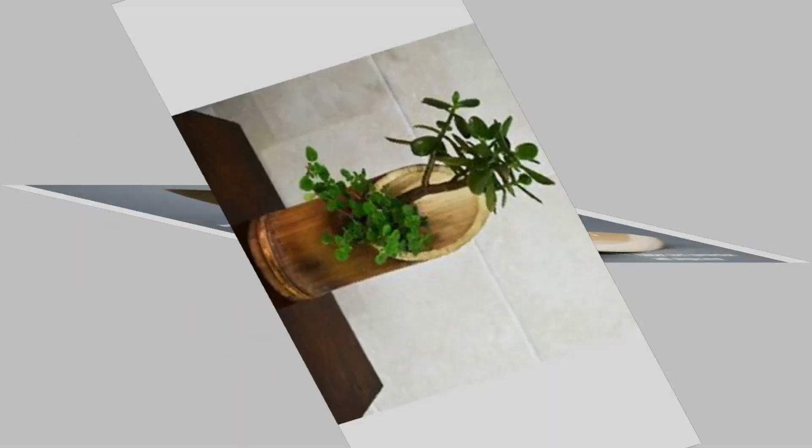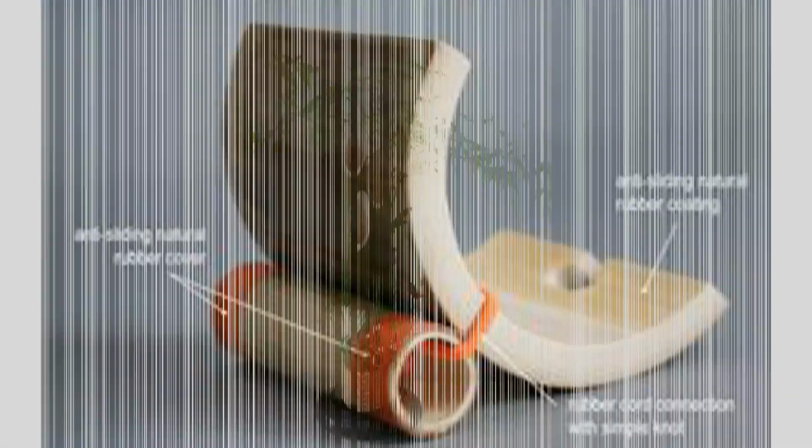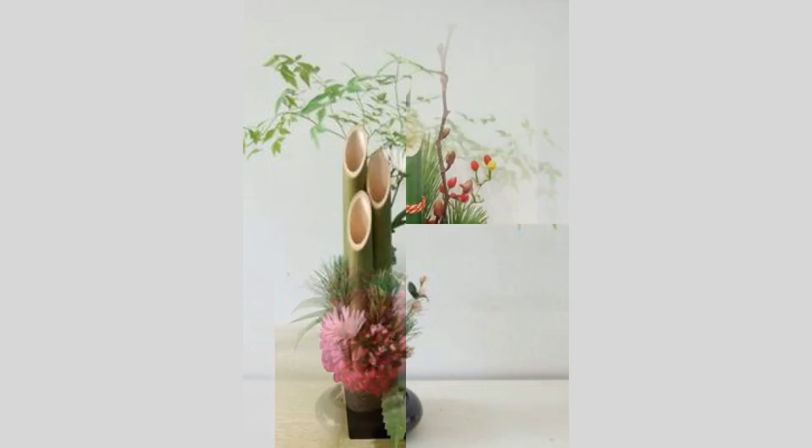First, mark a spot about 1.5 feet from one end of each pole that will form the bottom of your coat rack. You will then drill a small hole straight through each pole where you mark so that they each have an opening at the same height.